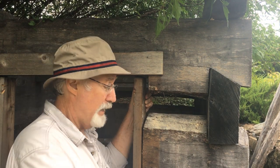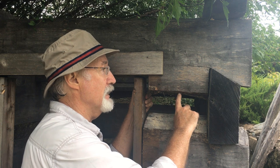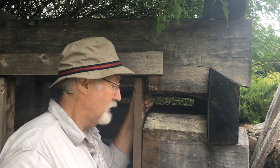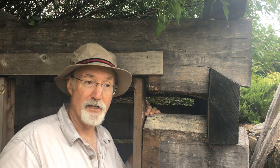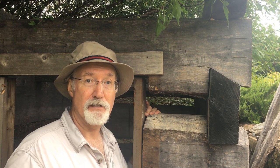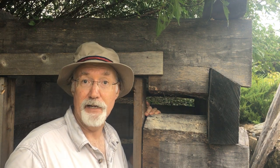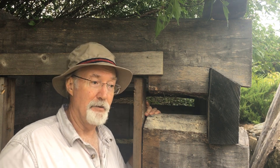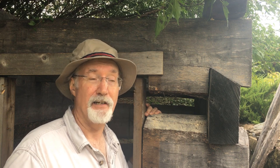Now, likely, had the entire cabin been chinked in the process of this, this particular chink gap might have been affected a bit. But if you saw in the previous episodes, I did some chink gaps on this, and I'm really surprised, shocked in fact. I've never chinked a cabin as green as this one was, so I was expecting some issues. But overall, when a cabin shrinks, it can shrink as much as 2 or 3 inches in overall height. But when it comes to each individual chink joint, you're looking at really about 1/4 inch. Your logs shrink, your chink gaps do not. I know that might not make sense, but it's the way it works out.